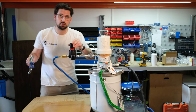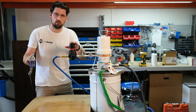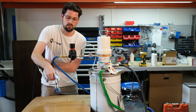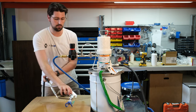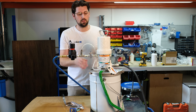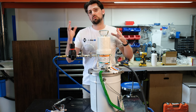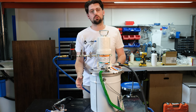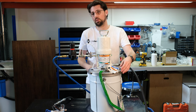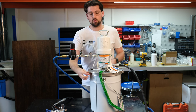It's as simple as that. All we need to do now is relieve pressure in the system — turn this all the way down, lock it, bleed the rest of the pressure in the line. Put your trigger lock back on so we're not spraying ourselves. Now we'll show you how to remove the lid from the 20 litre drum to either clean out, refill, or pack up and get ready to go again for the next job. You have three grub screws on the top of the lid that hold it in place. Make sure that the pressure and air is relieved in the system first before you undo these.